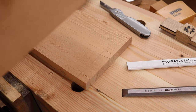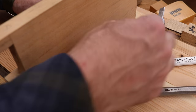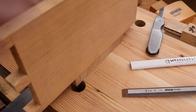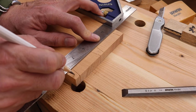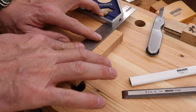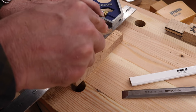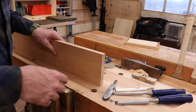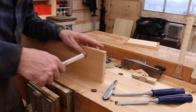Now we establish our knife wall. We slide the piece we're fitting into flush — it's essential that it's absolutely flush. Once we determine that it is, hold your square. It's not a bad idea to put an X on the portions of waste to be removed so you don't make a mistake. We take our knife and cut on the X spots — light first, then press harder.